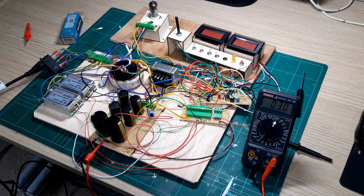So a valve running at 120 volts anode voltage, with a specification of 160 volts, I found them not to work, so it may be just that particular style of valve. Also heaters as well. I've got quite a lot of valves with 9 volt heaters, which I didn't realise. But that's going to be taken care of because I've got an external heater jack as well for further down the line. So I'll get that unit when I can and just plug those in.